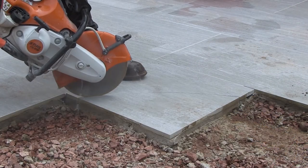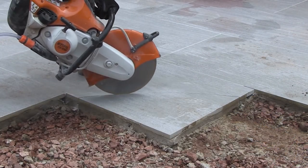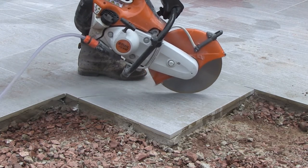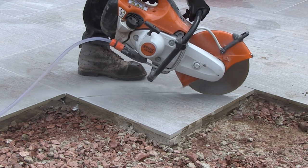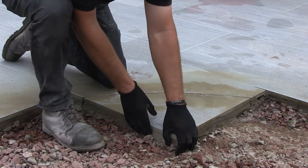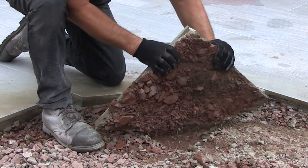Some installers will overlay the patio, which is basically making it slightly larger than it needs to be, and then as soon as you can walk on the paving, the whole curve is marked out and cut in one go. This is a great way to cut the curve as it gives a lovely smooth, professional finish all the way along the length of the patio.